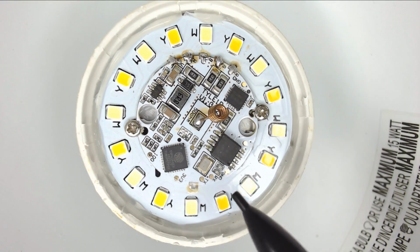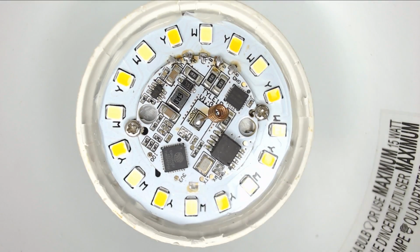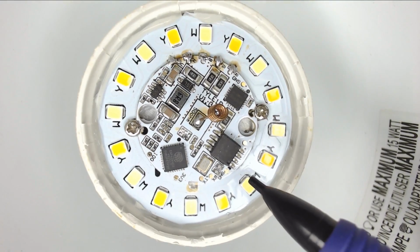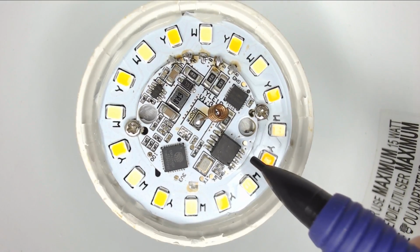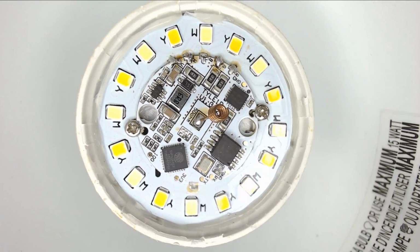This process is very simple. You just do an on process, and that puts them into pairing mode, and then you can use your standard Tuya convert, which again we'll link in the description of the video. So we're going to check out Tasmota on this bulb using the available firmware at the time of the recording of this video, and we'll show you one issue we run into, and then we'll put ESPHome on it to correct the issue.